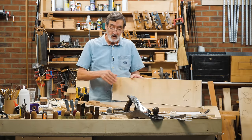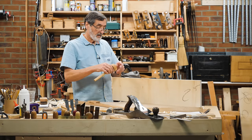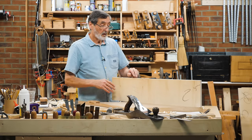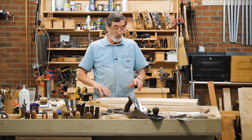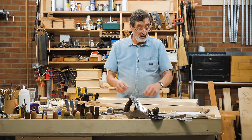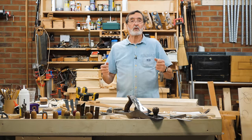After that, I take a marking gauge, set the thickness I want, run it all the way round to that trued face, and I've got a perfectly trued board — thickness and everything. So that's what I suggest you do because it gives you a delineation. You know exactly what you're working to.